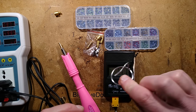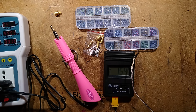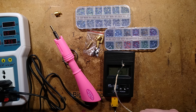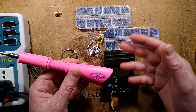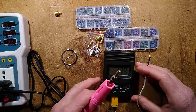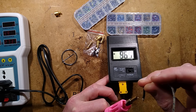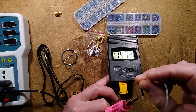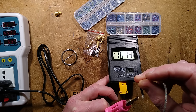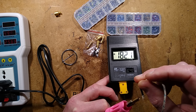Oh, there it is — a very simple stand. We put it like this, I guess. The power has stabilised at 10 watts. That's pretty good because it does say 10 to 12 watts, 100 to 240 volts, and that does suggest it is just a PTC thermistor. Let's stuff the thermocouple into the end and see what it's showing. 150 degrees centigrade so far — and climbing. It goes up to a fair temperature. You could get a fairly big burn off this.